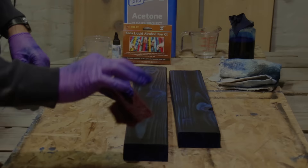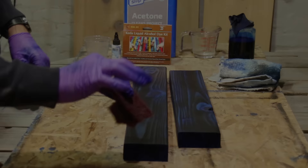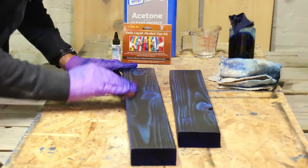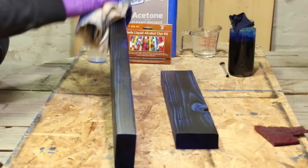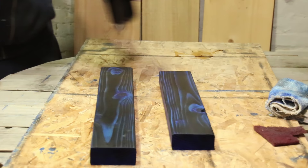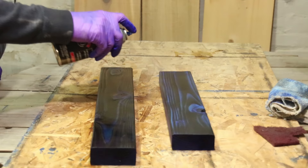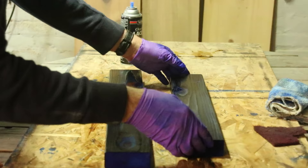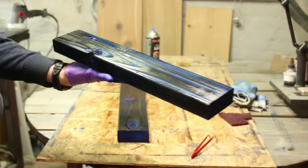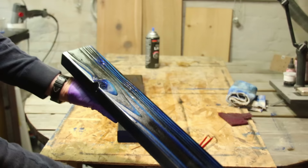It's probably not fully dried, but acetone evaporates very fast so it's gonna dry pretty quick. This is fully dried — you can see it's a little bit darker even with that acetone. So I took the red Scotch-Brite pad and worked some areas to try to add a little more contrast and have lighter areas in certain parts. The Scotch-Brite pad also helps to lay the dye out and blend it all in nicely. I used my tweezers to pick out some defects — I think that was actually from the red pad itself catching on a splinter, so just something to be aware of when working with softwood.